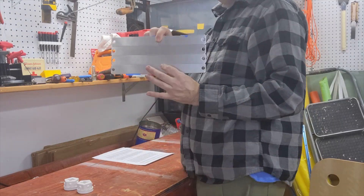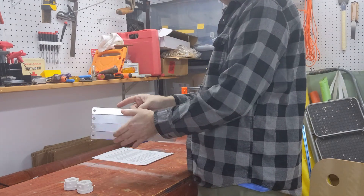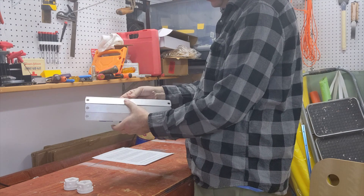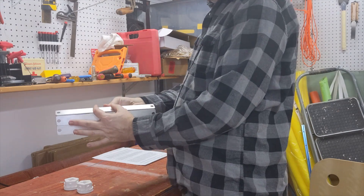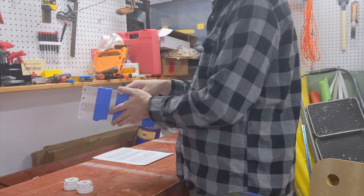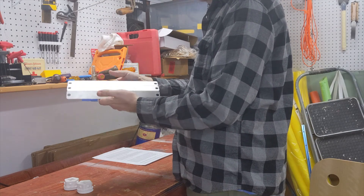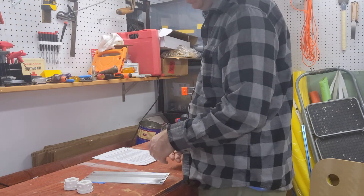I asked SendCutSend to cut me a bunch of laser-cut slats. These are 30 millimeters wide, which I consider a trade-off of the tedium of assembling the belt — the smaller these slats are, the smaller you can print. As this is, if you were to print something less than 30 millimeters wide, it would just ride the belt all the way around, unless you throw on a scraper. I'm going to use the PrintShift XL — the big belt for big things — and the mini for miniature things.